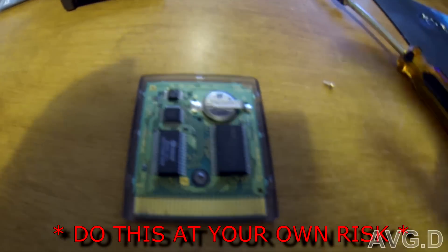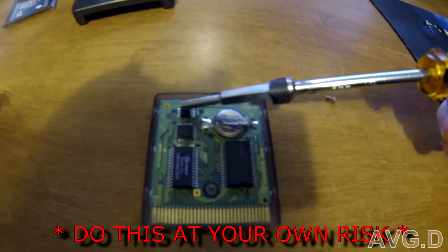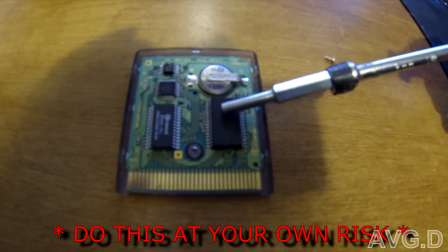Try it out and if that doesn't fix it, then move on to the next step. The pins on this upper left chip and the pins on this right memory chip — we need to reflow the pins.